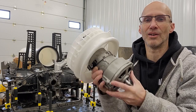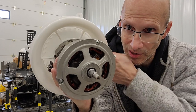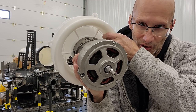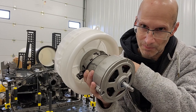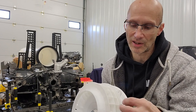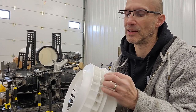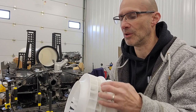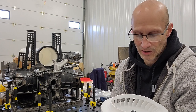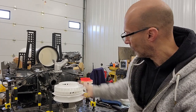So that's the reasoning behind it and how this thing looks. I want to do a little better alignment of the fan ridge with the inlet — we're going to open that up just a little bit more so the airflow lines up better. We're also going to change some dimensions; this side of the fan is likely to get a little bit bigger, which will increase the airflow. Generally speaking, I think we're in great shape — just a little more iteration to get the design finalized and we'll be good. So that's the Evolution 2 fan shroud cooling system and what we're doing there.